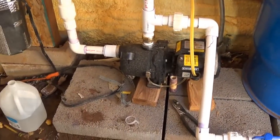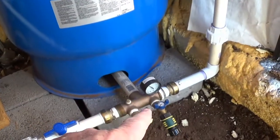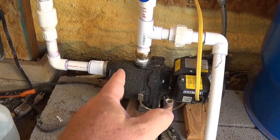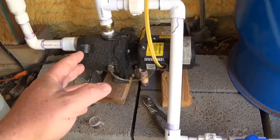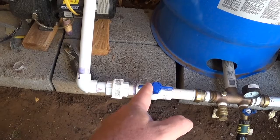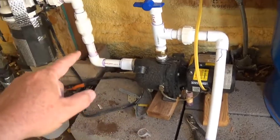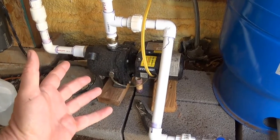When this thing was cycling on and off, what was happening was the pressure tank was at 50. I checked the valve — it's at 50. This one here would hit 50 and then drop down to 30 really fast. Here's my logic: if this check valve shuts off, then this section is holding the pressure — which should be perfect. So I know there are no leaks and everything is fine. But between these two check valve areas, I'm losing pressure. How is that possible?